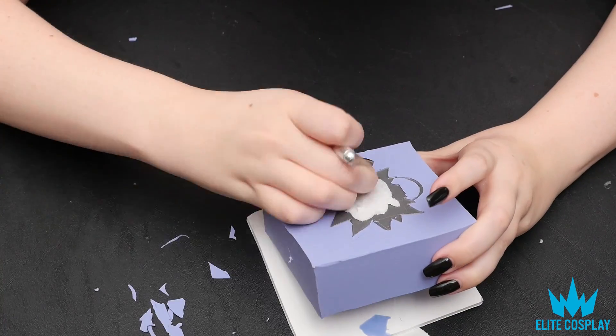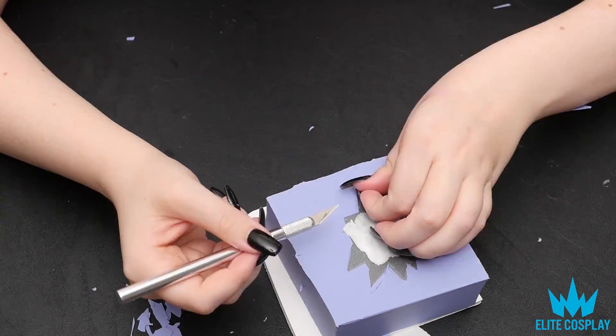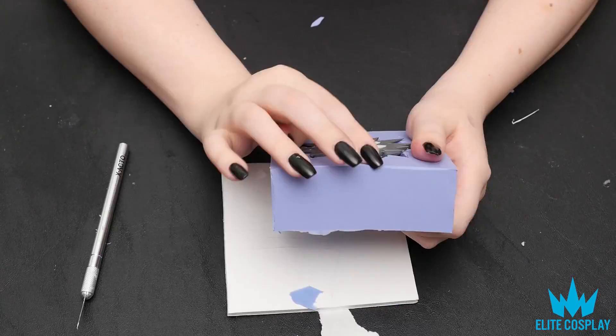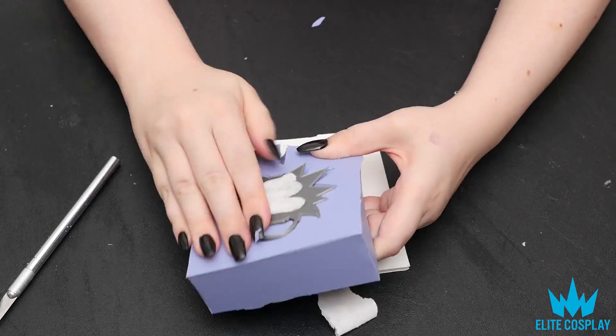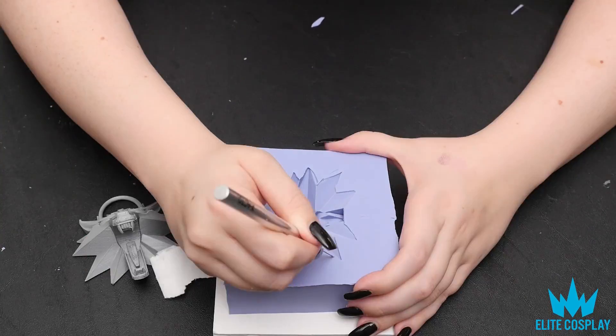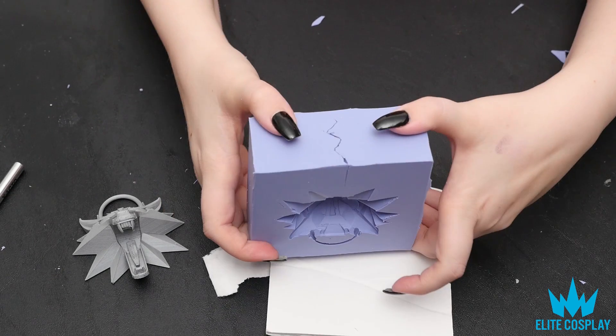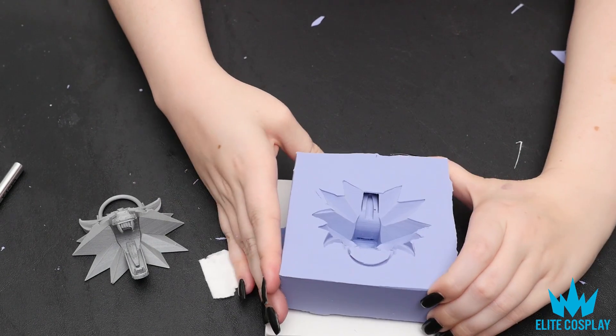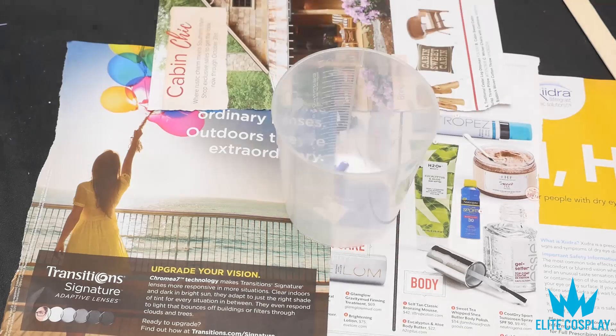Back to the side zigzag — I made this as a secondary feature to make it easier to push objects out of the silicone, since objects can be kind of hard to get out. The zigzag is so the mold can fit back together like a puzzle piece. If it was just a straight line, it wouldn't fit back together perfectly, and then you might have some problems with the resin.